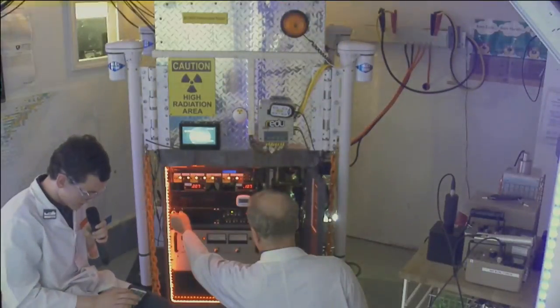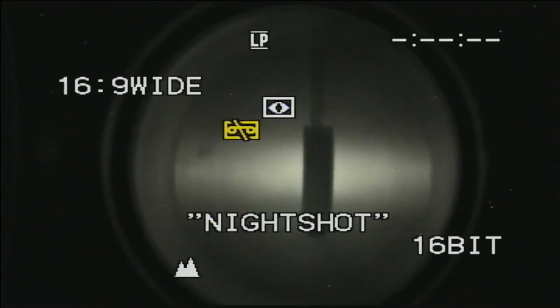I don't know if you can tell, but if you look at the video in there, the beam's got a lot cleaner, a lot less spread out. It looks a lot less like coronal discharge, a lot more like a beam plasma. Inside that conflux chamber I showed earlier, you've got that big high voltage feedthrough in the center, the ring you see in the center of the screen right now. And on the ends of the reactor, we have titanium. The titanium is there so that when the deuterium ions accelerated by the beam hit it, they get stuck there, and then another ion can come along behind it, hit it again and fuse.